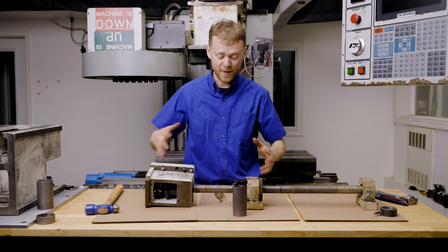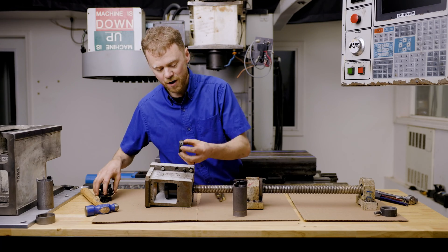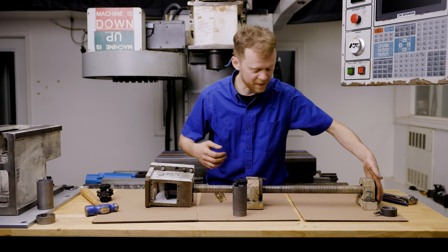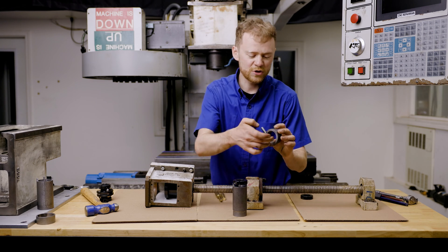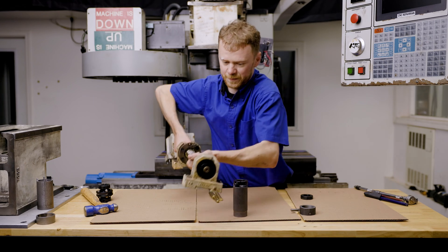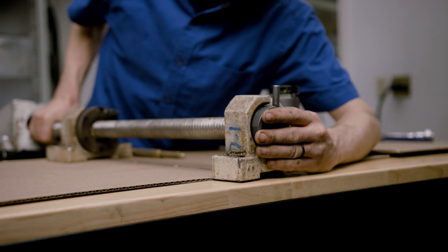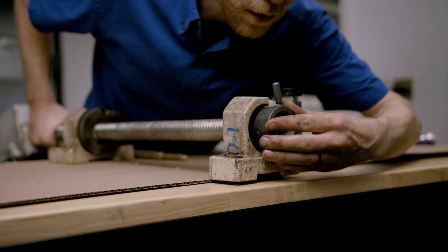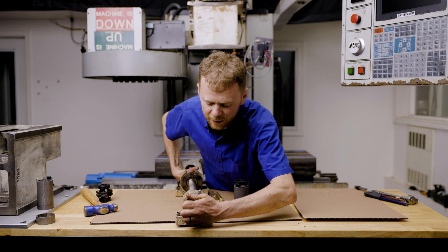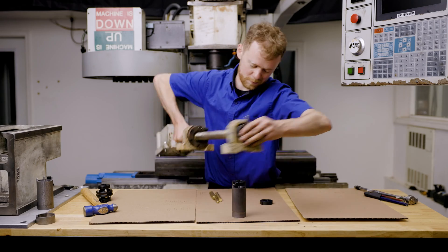So all together — coupling, motor. We have a video about how to pull this stuff apart on our channel. So pretend the coupling's out. The lock tool has two pins and a dowel pin up here that allows you to lock the ball screw. You can see this fits right inside of here — it totally locks in there. Now I can't turn the ball screw.